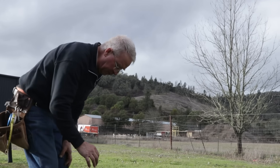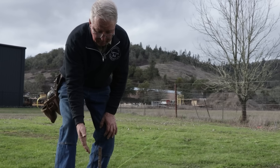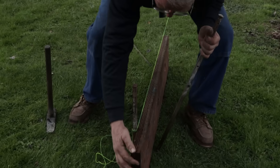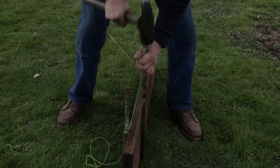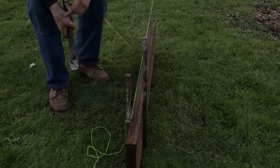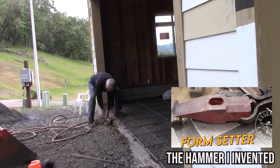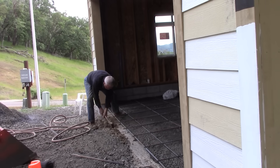So let me show you why it's important that your line stakes are on the concrete side of the string. You want to put forms up? Now the forms can go right by the line stakes without disturbing them. See that? If the string would have been on the other side of the line stake, you couldn't run the form wild. See the beauty of this hammer? If that grade was too high, boom — you can chop it out.